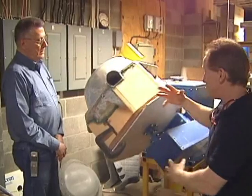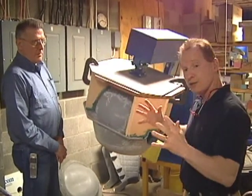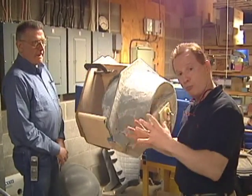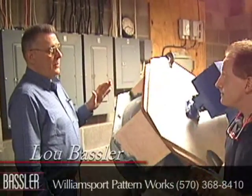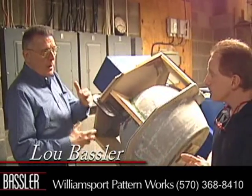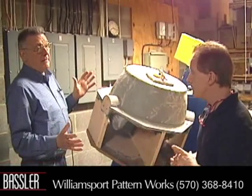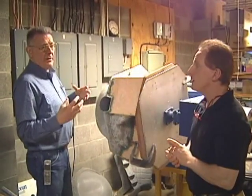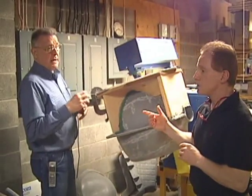And this thing just spins around, and the liquid polymer or plastic goes to the outside edges, which you see here, this round shape, and it starts to build the product. You'll notice that the speed of this is not really fast. The material in there is really kind of rolling around, and the inside of the mold becomes the outside of the part. This makes a hollow part without having to create that hollow inside using another process.